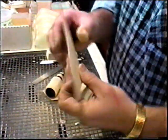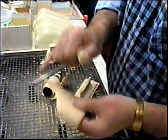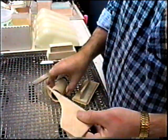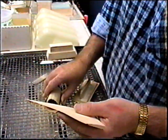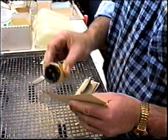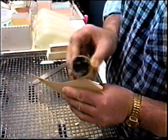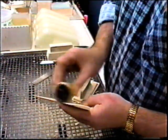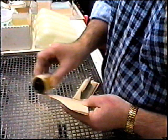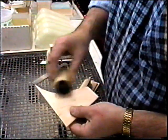Now when you get down to having it nice and thin like that, obviously you run a bead of thin CA along both sides to harden up the wood, or else it's going to be so vulnerable, so delicate. And then what I like, it just turns out a kicker bottle is just about the right dimension. I like to get a radius back on everything, because sanding it out, it winds up being a little bit like a razor blade. Kicker bottle has just about the right radius.